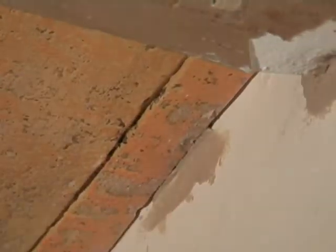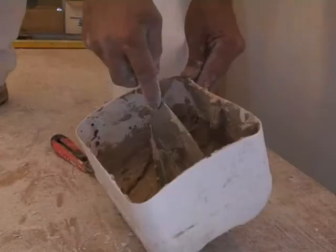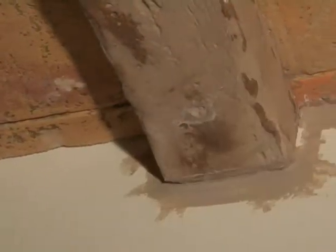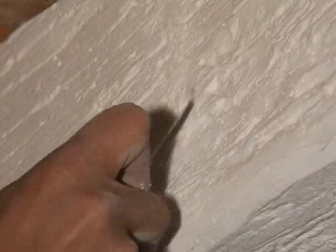Along the walls, the ends of the beams, the screws and the tiles will need to be filled in with a colored spackle. The effect must be one of where the beams are inserted directly into the wall. Clean off any excess and sand where needed, being sure to follow the grain.